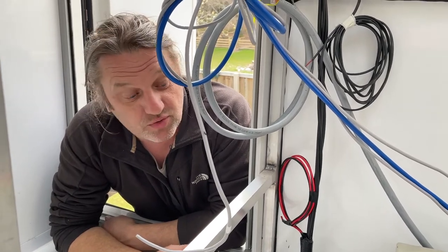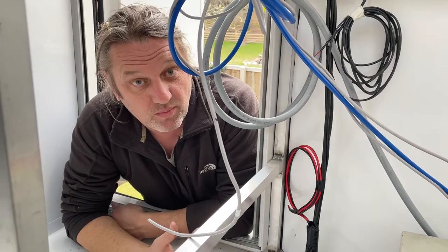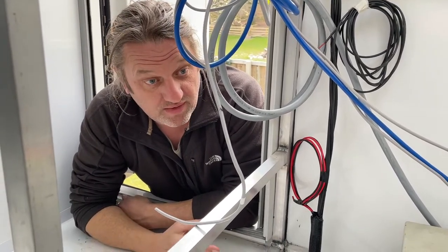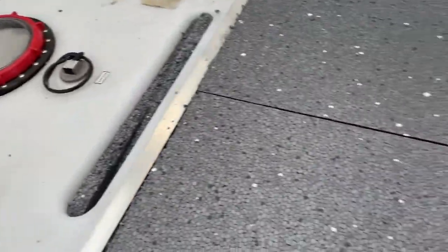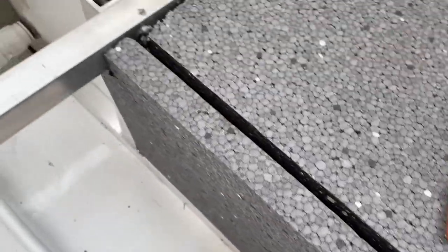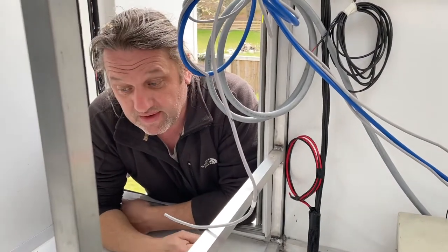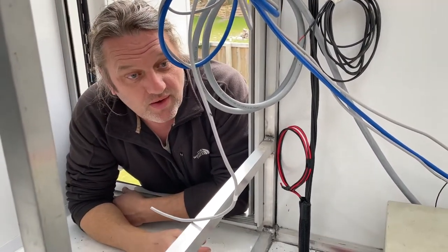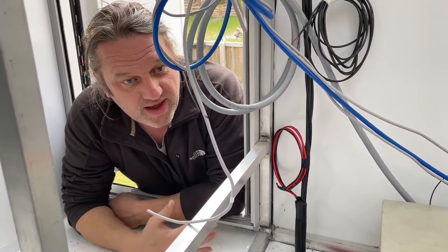Once we're happy there's no leaks in any of the joints or the tank or anything, there's no issues, we'll then carry on insulating. You can see we put just a little bit of insulation on top there, and then that's going to get sealed up with insulation tape, and we're going to go right round the entire thing. Obviously not the bottom because it's not under there as it is, but the floor is insulated, so hopefully that will help with keeping the water nice and cool and condensation and things like that